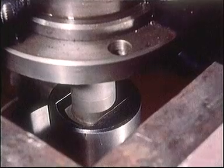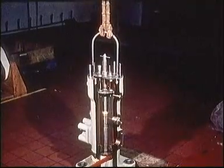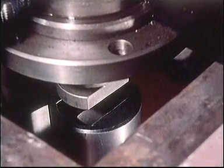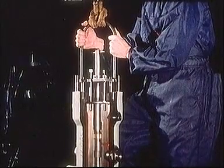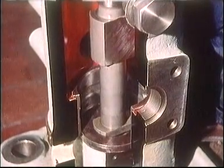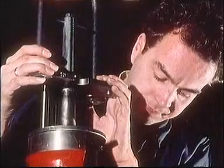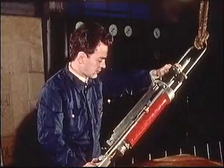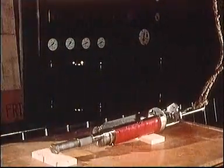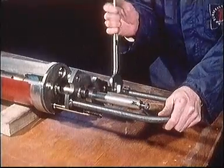Raise the plunger some 10 to 20 millimeters by hand and press down the locking ring against the crossbar and lock it. Then carefully lift out the plunger and barrel assembly and lay it on a couple of wooden blocks. Dismantle the lifting tool and push the plunger entirely into the barrel.